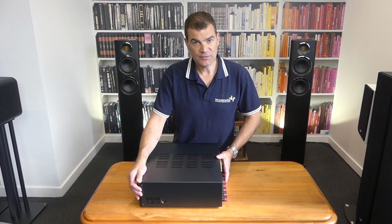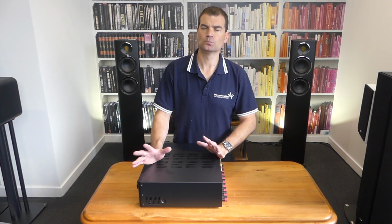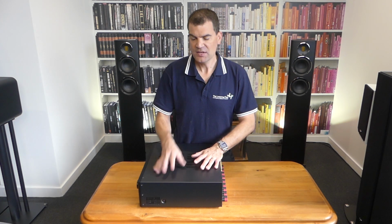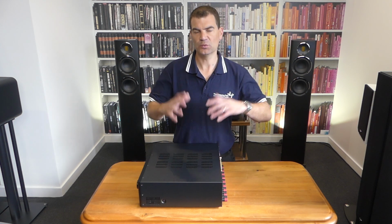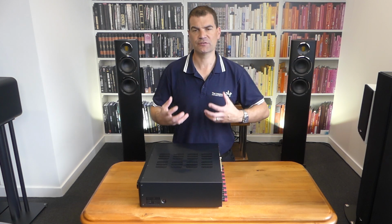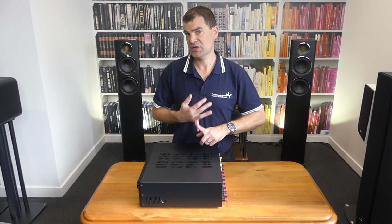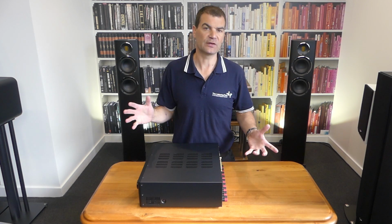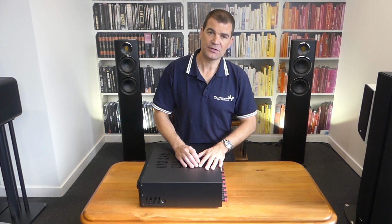it's not as deep as many others, so given its power, I mean this is actually NAD's power. This is 9 channel 85 watt, which is what NAD calls full disclosure power. Now, full disclosure is about when you are driving absolutely all of the channels simultaneously into full frequency response. Now this is hard out, and then measuring the wattage.